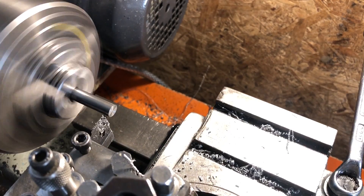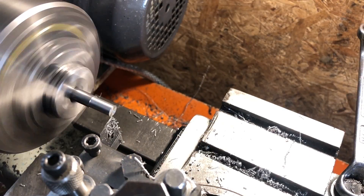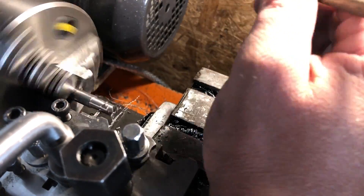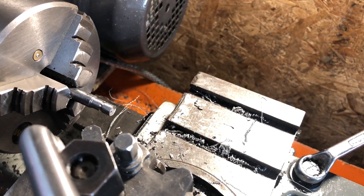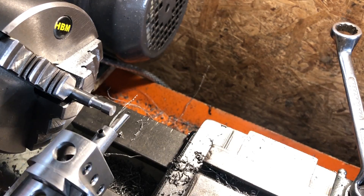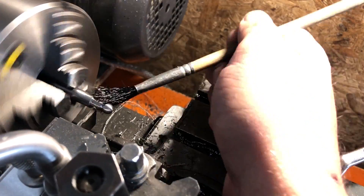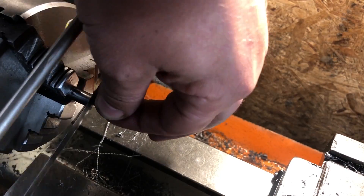Both the supplied stock and the specified ball dimension are a quarter inch, so to allow me to take a full cut and remain at size I'm starting with some 5/16ths bar from my shelf - although if you wanted to use the supplied material a few thou undersize would make no difference at all. After facing both ends I'm starting by turning down to 0.26 and then creating the runoff for the ball with a round nose form tool with a chamfer ground on the left side. With that runoff to depth I can turn down the shoulder dimension before setting the ball tool, then it is just a simple matter of forming the ball down to quarter inch. With that to size I can touch off and move the parting tool to create the shoulder, taking care to remember that I enlarged the corresponding hole to 1/8th earlier in the build. Severing the part with a saw and it's done.